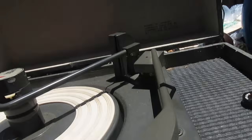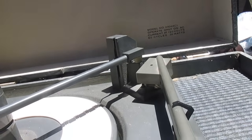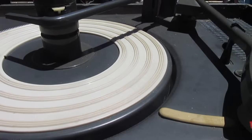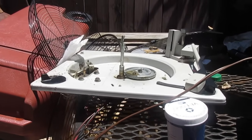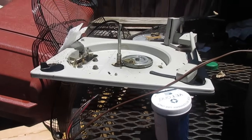Yeah, we hear popping and crackling in the speaker as soon as we turn it on, so it doesn't even have time for the tubes to warm up, so that sounds like something power supply related that's taking place there. Now the first thing we're going to do is replace the transit screws on the changer, and this old parts changer will be a good source for those.